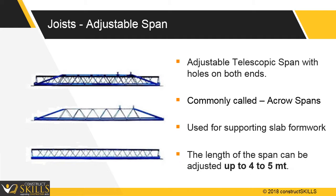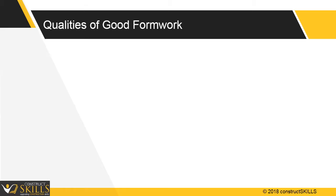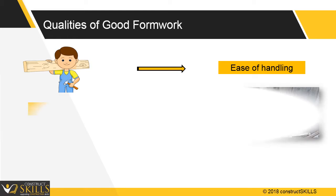A table compares the advantages and disadvantages of different shuttering materials. Factors to be considered while selecting shuttering material include: quality of finish required, ease of handling depending on the complexity of the structure, weather conditions, and overall cost investment. General criteria that govern formwork are: ease of erection and stripping, quality and accuracy of shape and finish, safety of carpenters and the public, and care and maintenance.